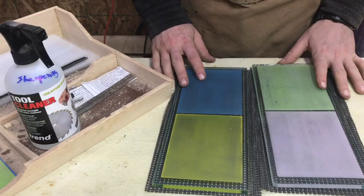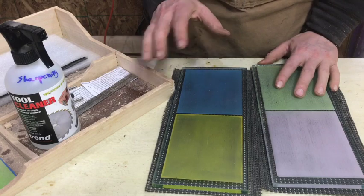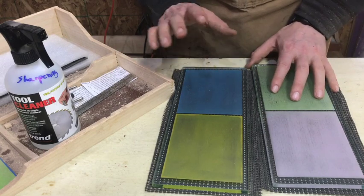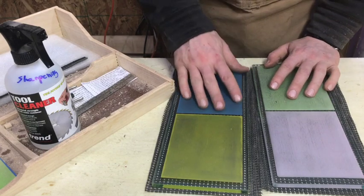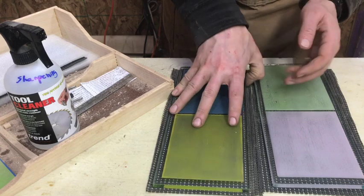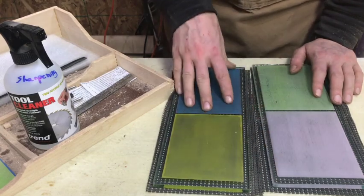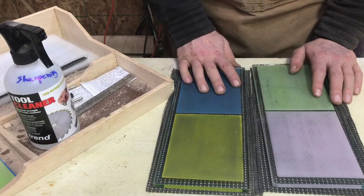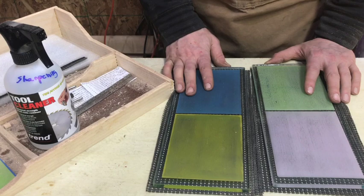The next tool I really love and I use all the time is the Scary Sharp sharpening system. Now, I know this is a bit controversial, as some people swear by stones, wet, diamond, whatever, but I really love this. It's essentially lapping film, that sticky-backed paper that you put on glass. The set comes with three plates of this glass, three of these mats, and a sheet of each of these films. It goes from 300 grit, I believe, all the way up to 60,000.